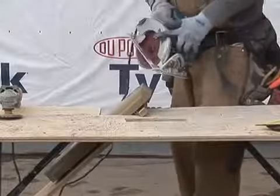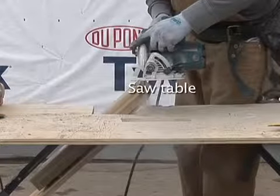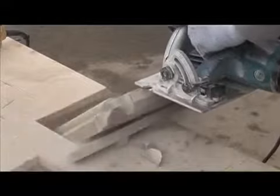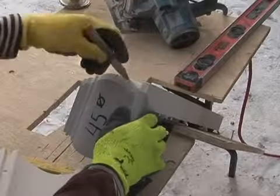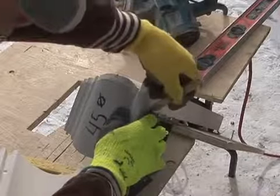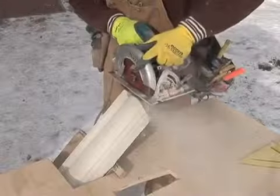The quirk miter is cut like this. It is very important to hold the saw table of your circular saw perfectly horizontal in order to get a perfect 45 degree miter. Here we can use the 45 degree template to draw out where you will cut for our quirk corner. Now cut as seen here. Remember, make sure you're holding your saw level to the table to ensure a good angle cut.